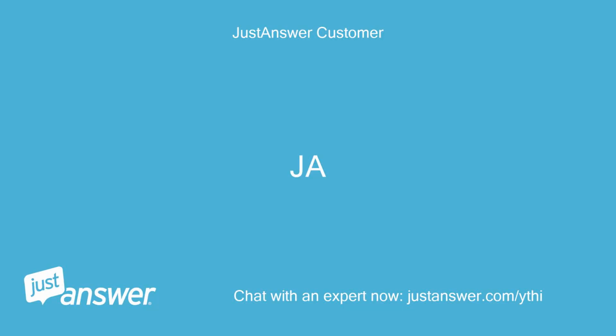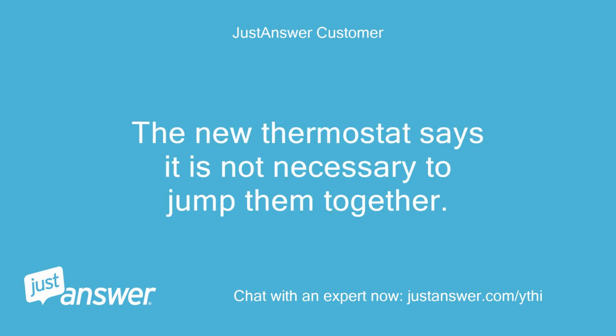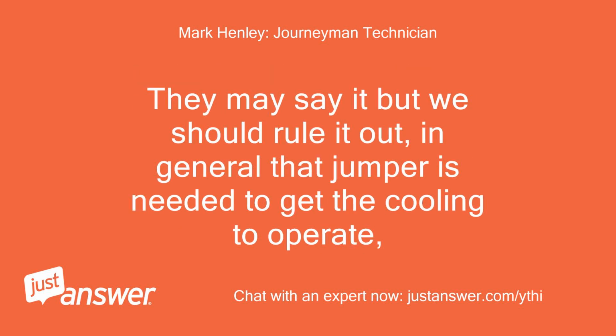There is a RC and it has no wire on the last thermostat. The R and RC were jumped together. The new thermostat says it is not necessary to jump them together. Mark Henley: Okay, you will need to add a wire that goes from the RH terminal to the R terminal, so a short piece of wire wired to both of those terminals. They may say it, but we should rule it out. In general, that jumper is needed to get the cooling to operate.